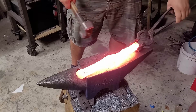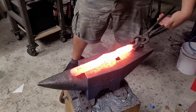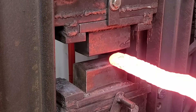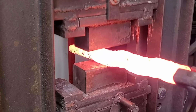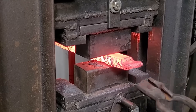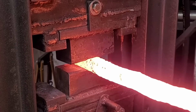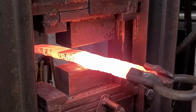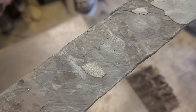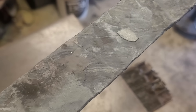Here I'm just going to try to straighten it up a little bit before I go and flatten it under my press. Then I'm just working it down to a consistent one-quarter inch all the way through so I can use it for my outside cladding on my knife. You can really see that grain starting to pop out through that forge scale — looks really, really cool.